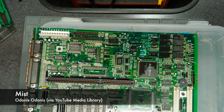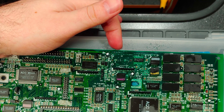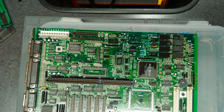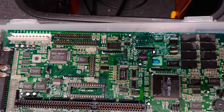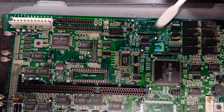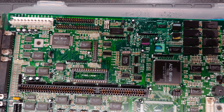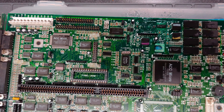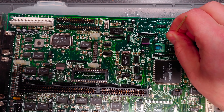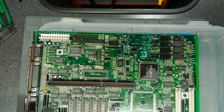When we left off in the last video, we discovered a ton of corrosion on the board both top and bottom, including traces that are literally just falling off. I went ahead and soaked it in white distilled vinegar, sprayed the top, and on the bottom I put a sheet of cottony-type paper to have it soak in. While that was soaking I went and scrubbed, and as you can see this GNS 9330 chip still has a ton of corrosion on it.